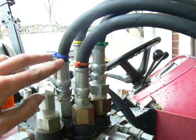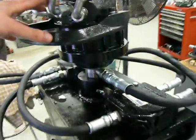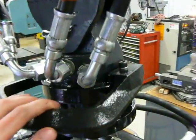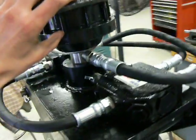And there are the four color-coded work ports here that go down the boom. Two of which on the rotator operate rotation in either direction, and then the other two hoses supply fluid that goes through the rotator.